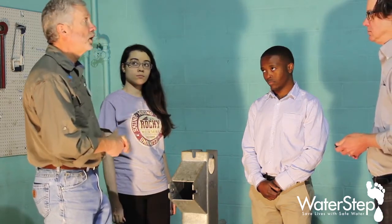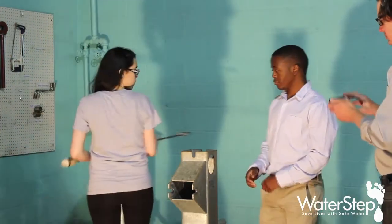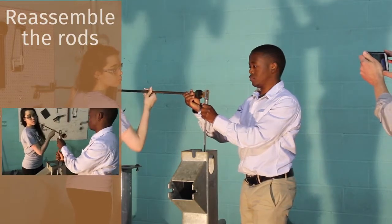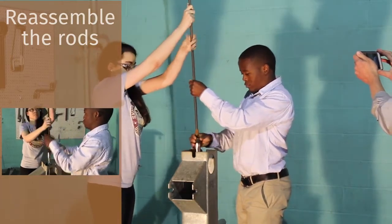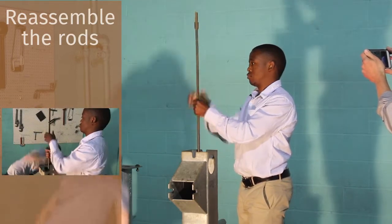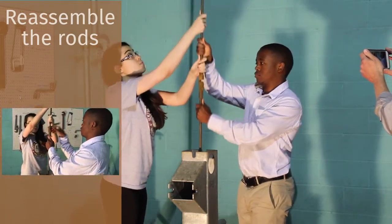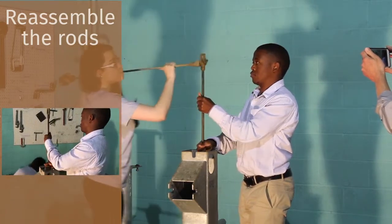Our bottom check is now in place. We start with the top check and sucker rod, then reassemble all the way down. We take our top check, get it started down the rising main, then take our first piece of sucker rod, latch it on, raise it up, then slide the rubber piece down to lock it into place and hold it in the center of the rising main. For safety, make sure you've got at least two hands on the sucker rod as it goes down. Continue replacing sucker rods, lowering into the well — they lock into place. Keep lowering until you reach the last sucker rod.